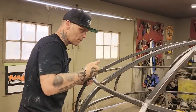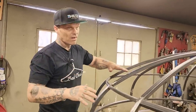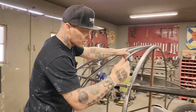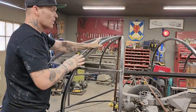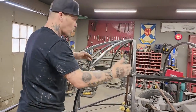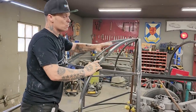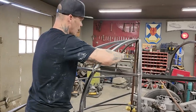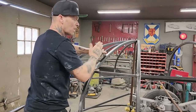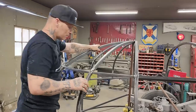We have the shape here. And then we can roll it back to Gwenda there. Where I've made everything out of an inch, I'm hoping that everything will land in the center of the 1-inch square stock. And then I can weld it to the square stock and weld each piece together and have something there to hold it up. You know just as well as I do, when you have two pieces of metal come together and you're butt welding together and there's nothing underneath of it from falling, it's a little harder situation.